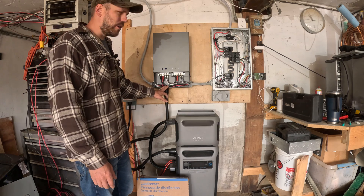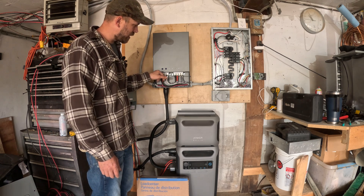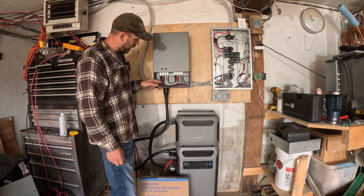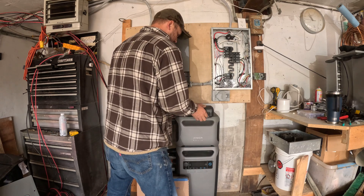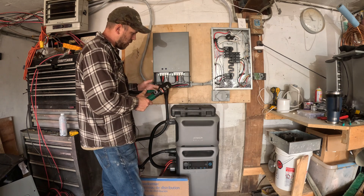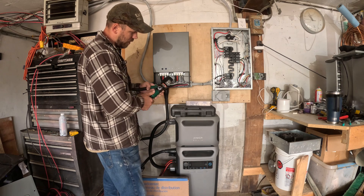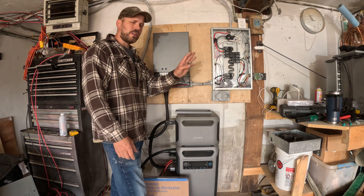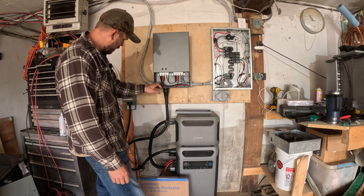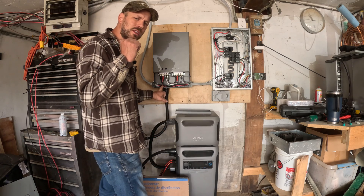I've got the panel off here so you can see how I got it all wired in. One thing I didn't like about the setup is I wish they didn't have ring terminals here — I wish they had standard clamps like on the back of a breaker where you just need a screwdriver. Because they don't have that, you're going to have to get a special tool — a hydraulic crimper. They're fairly inexpensive. You'll strip back the wire, get your ring terminals, and crimp the ring terminal right on the end of the wire. I'll put a link in the description for the crimper and terminals. Once you get it wired up, line one is black on both, line two is red on both, and I made sure the panel back in the house is also the same way.